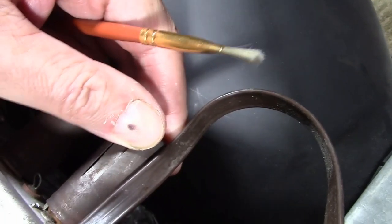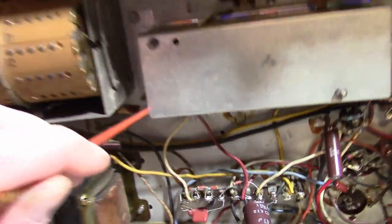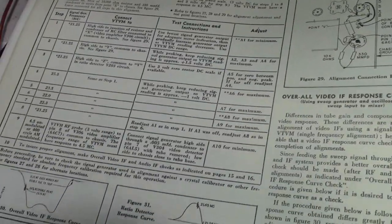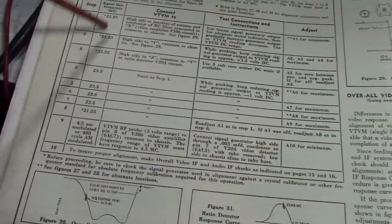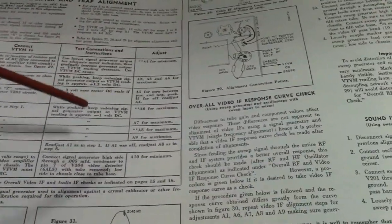The only real thing of interest is how you inject the signal — you don't go through the antenna terminal because we're bypassing the RF local oscillator and mixer. What you actually do is lift the tube shield up a little bit, wrap the bottom with electrical tape, and clip the high side of your RF generator to the tube shield, putting the negative to the chassis. This capacitively couples your RF signal via the shield into the inner tube elements and it will go into the TV IF. You could also clip it at the output of the tuner, but this is generally how they tell you to do it because you want a really low level signal and good isolation.